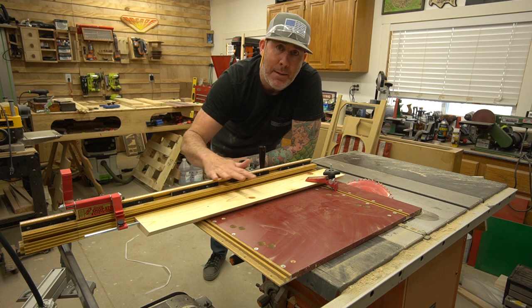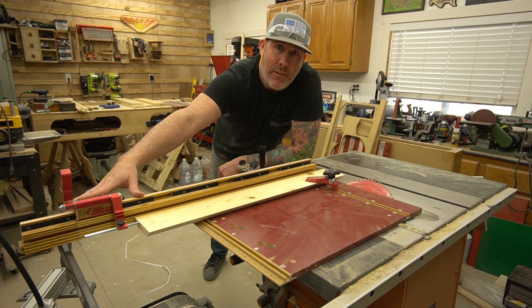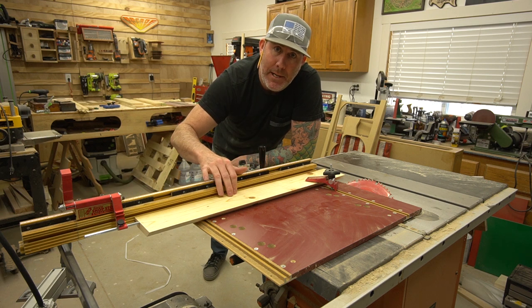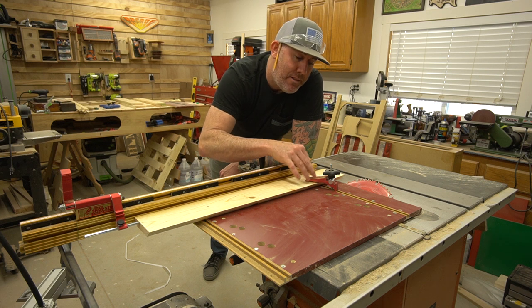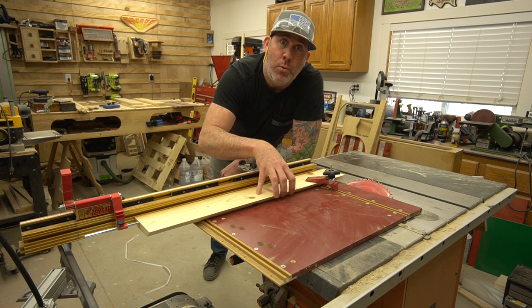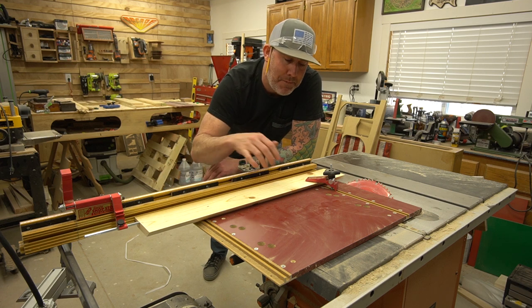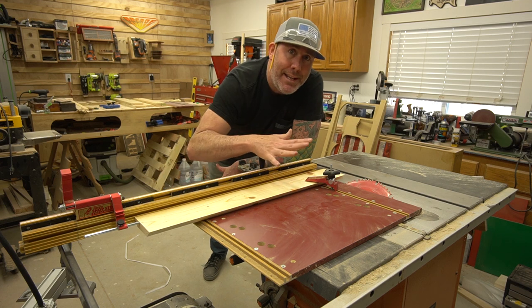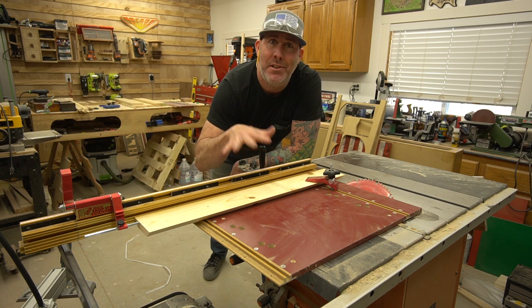What I really like about the Incra is the nice parallel straight fence and a stop at the end. So every piece of material I put in here goes right up against the stop, and then a clamp holds my wood really tight. All of these pieces are the same length, so for my first series of cuts I'll put each piece in, cut one end off, then reposition the stop block and finish cutting the rest.